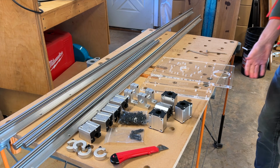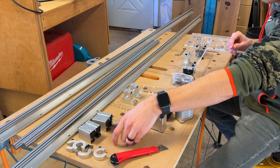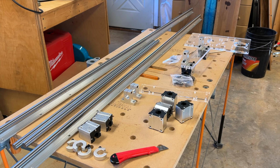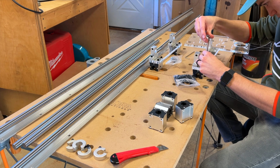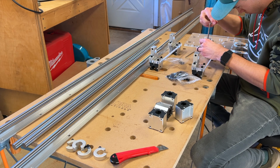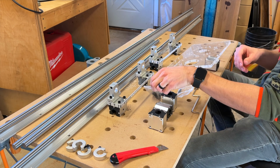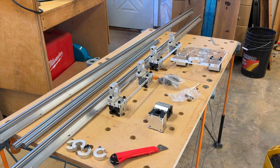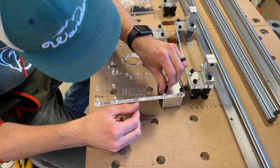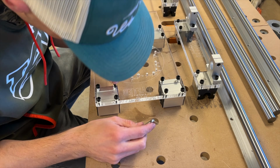So the first step in the process is we need to flatten the slab. And for that, I'm using this router sled from Crafted Elements. The way I think about this router sled is that it's basically a CNC that's powered by you instead of a computer. And we'll be able to take a twisted or uneven slab and make it perfectly flat with this router sled. I love this sled. I will leave a link to it in the description and you'll see me use it here in just a second as well.